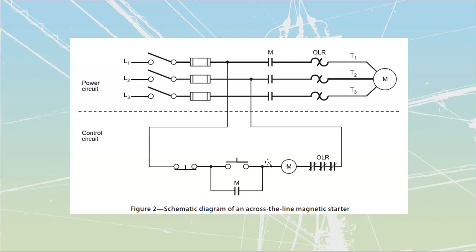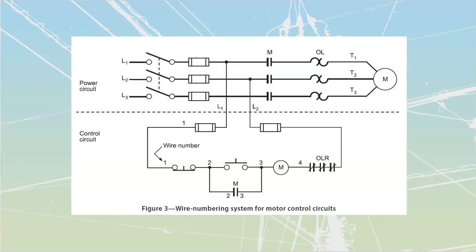I'm going to show you a couple of shortcuts as well because in some cases it really makes your wiring a lot simpler. But for now, let's start by going through and numbering. Organization is going to be a big part of how we make this conversion. You need to identify absolutely everything, everywhere, so that you understand what your components are going to be. I'm going to label over some of what they have because they should actually be labeling everything at every point, not just one point. It gets too hard to follow, but we're going to label everything at every point.